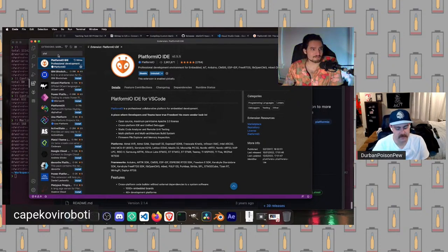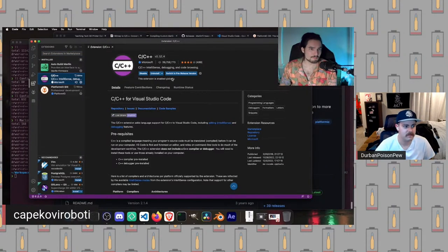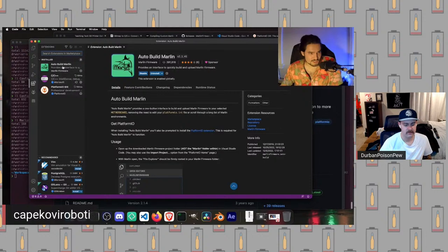Once that's done installing, you may have an issue, which is that it does not always correctly install its dependency. One of the things it depends on is this C++ plugin from Microsoft. So we're going to install that. And then finally, we're going to search for Auto Build Marlin. That will bring up Auto Build Marlin, and we're going to hit install on that. Once that is complete, when you go to your extensions page, you should have three installed extensions over here in this tab. And it should look very similar to this.